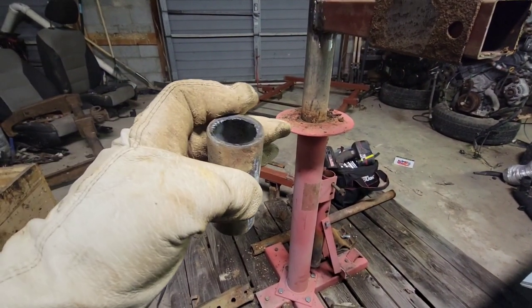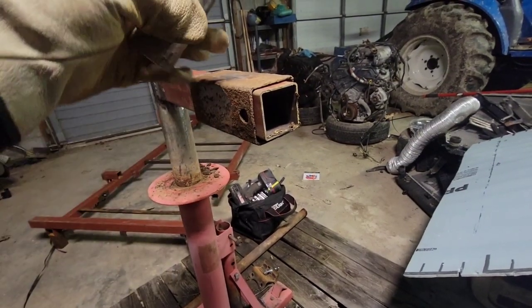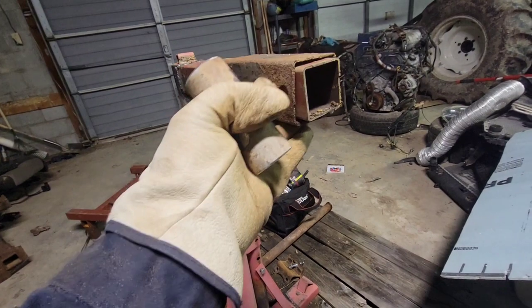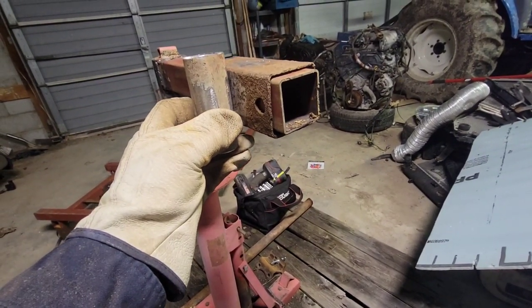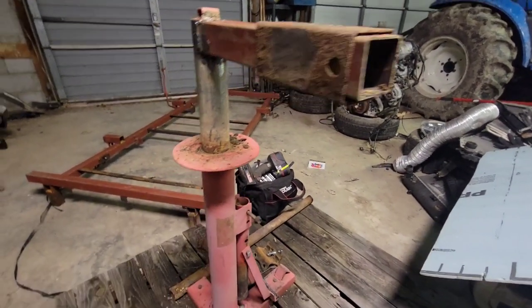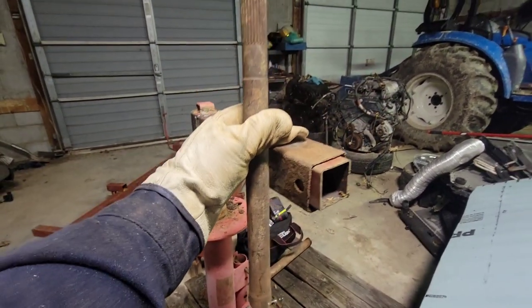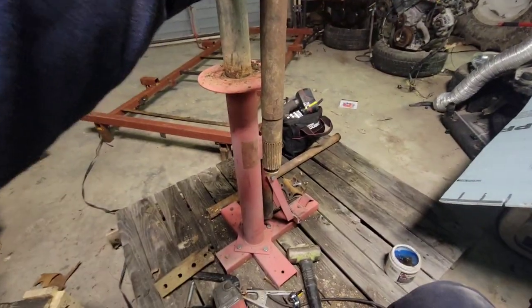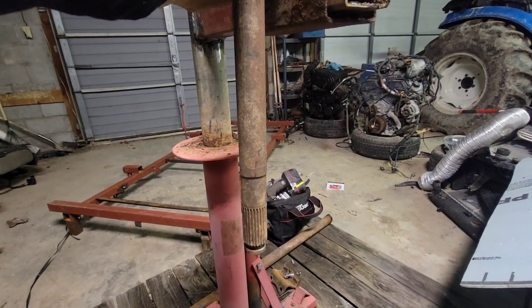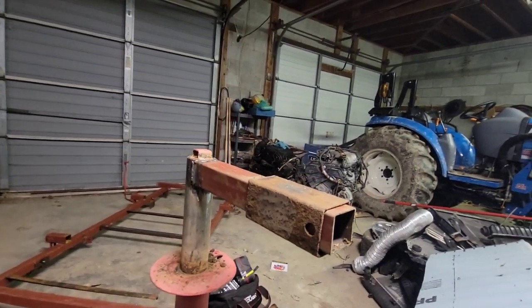What I got here — this is galvanized. Just what I had. I've grounded it off. I'm going to put this on here and drill it right here, put a T-handle bolt of some sort. I'm going to weld this on, put a hole in it, put a nut in it. My idea is for this overkill piece of car axle to go down through it. It's bigger on the top than the bottom, but I think that duck bill with the set screws will set up better on the axle splines. I can maybe make a couple flat spots in them — give it something to bite in the long run.